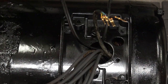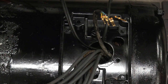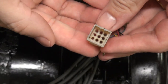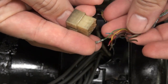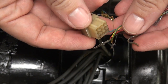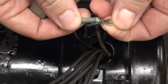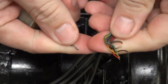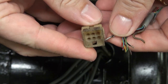We got the motor back from the rebuild shop, and unfortunately it didn't go as well as I planned — this motor was in very, very poor shape, but more on that later. Now, one of the things machine builders do — and I don't know why — is they love these Molex connectors. The issue is that if you saw the disassembly, this connector had sort of strain relief on it, but they put the zip tie on so tight they pretty much crushed the wires. This wire is 28-gauge wire, so it is very fine and breaks very easily. With almost no force you can rip these pins off, and Molex connectors really don't provide good strain relief.